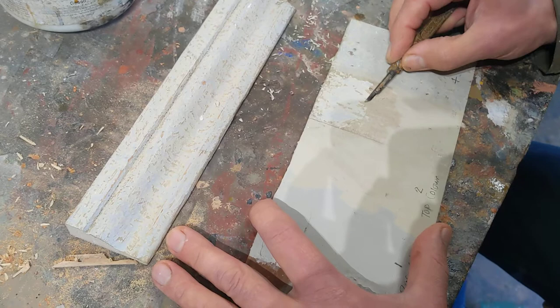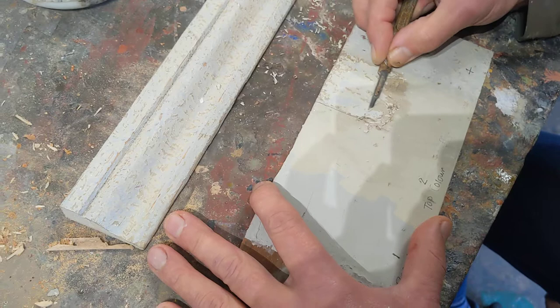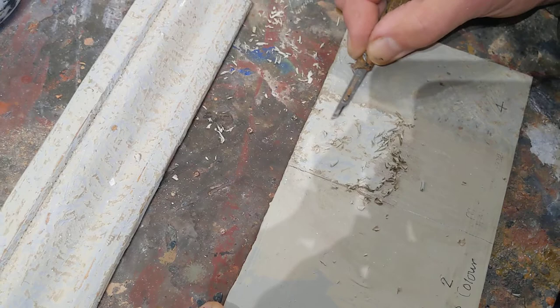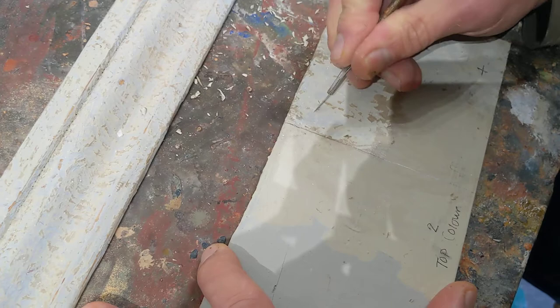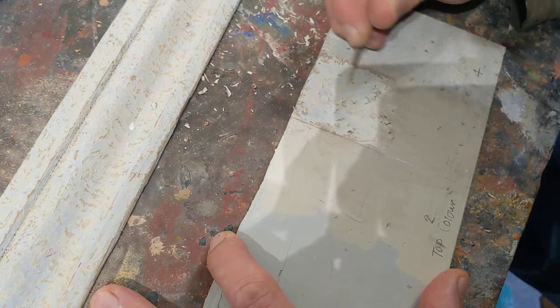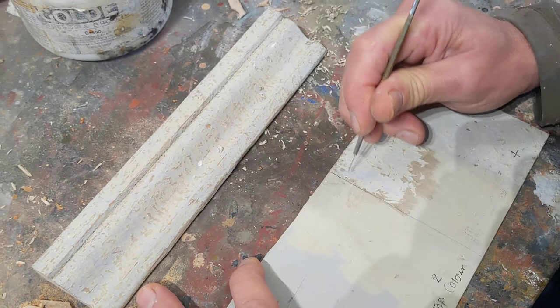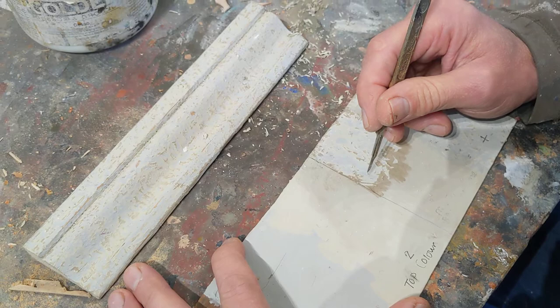You've got to experiment anyway. When you get going on it, you can be quite quick. I'm doing it a bit slowly because I'm showing you. I'm going to leave that little bit there because it gives you the colour. Then use the tip of the scalpel, because it makes it look like it's been dry stripped. Because when you dry strip, you don't go in one direction necessarily — especially if you're doing carving, you find yourself having to go all over the place to get in there. And you'll find that if you're doing areas which aren't easy to get to, like in the vein of a leaf, sometimes you go down to the wood when you're actually dry stripping. So you might want to do that occasionally — you can go deeper.